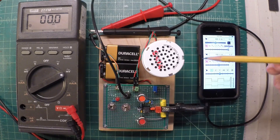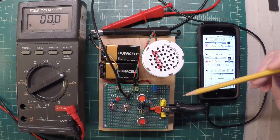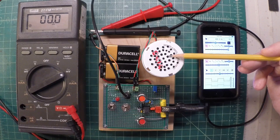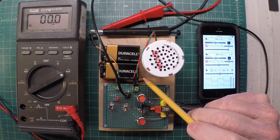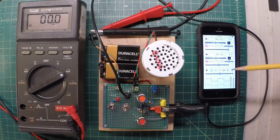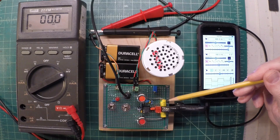Hi folks, thanks for joining me. You're looking at another prototype I built early on to kind of sniff out the outer foil of a capacitor or a shield. I've got a little mini speaker here and my voltmeter hooked up. I'm sampling the AC voltage here that drives the 8-ohm speaker. I'm using my smartphone and an app on it to drive the input here across the capacitor.